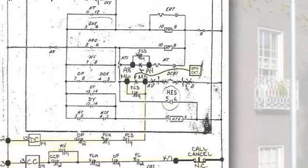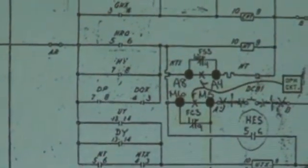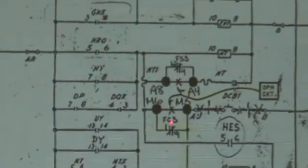Capacitor with the little resistor mounted on top. You take the wire off the little resistor, move it to A8, and put a new wire from A4 back to the resistor. You can go either way with it, as long as you make sure that you isolate all the wires. Here's another good example.